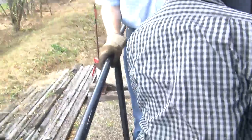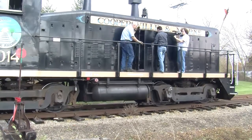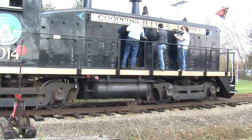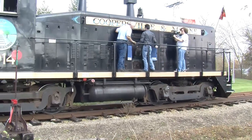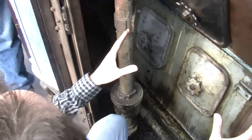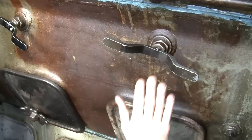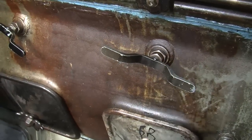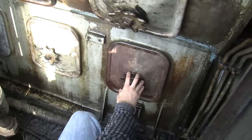All right, now we're going to get into the prime mover. This is only one section of the 1200 horsepower diesel engine. Yeah, it's 1200 horsepower, 12 cylinders, diesel, and we've got the blow-off cocks here. They are our air test cocks. Okay, and this is for valve gear? Access to our valves. And then this is access down to the crankcase. But this is the engine. That is the engine, the diesel engine.